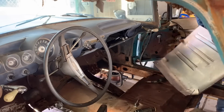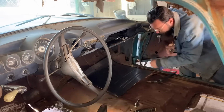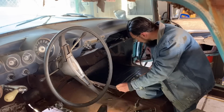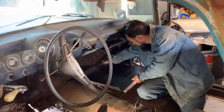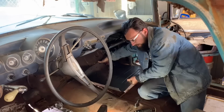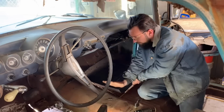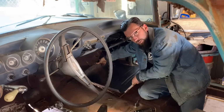All right. So, we're pretty close on our floor here-ish kind of thing. No matter how well you think you cut these, it's never 100%. And what we're gonna have to do, line up the top, because the top lines up pretty well. Put a tack in it, and then just start, you know, whipping it into place, because our bends aren't 100%. See how it's hanging up here? We'll have to bend it down and probably fold these ends over a little bit and kind of just work it in. I mean, you know, they're made from 100% scratch, so.